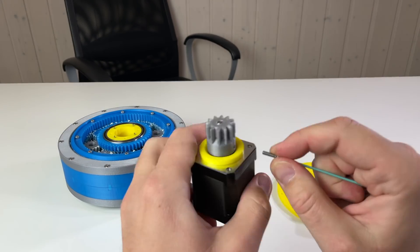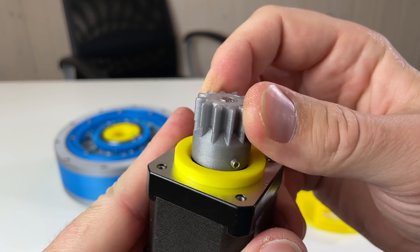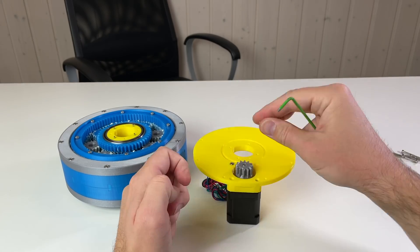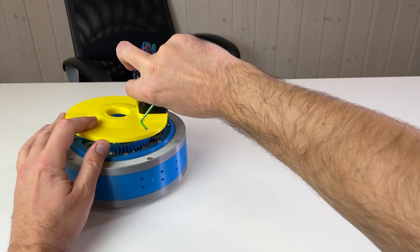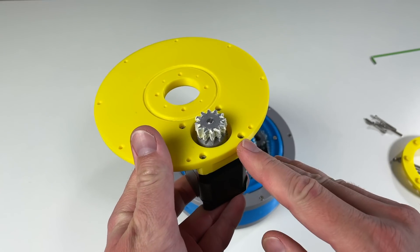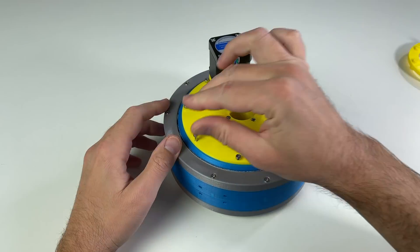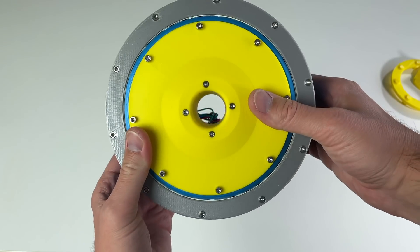The piece goes all the way in — here it's flat and it still rotates freely. The small headless screw goes on the side; my screw sticks out a little bit but doesn't touch anything, so it's perfect. The stepper motor is fixed with four 14mm M3 screws. I put grease on the small gear and on the bigger gear, align all the holes, and we can assemble it. It's huge but I really like it and I hope it's going to work well.